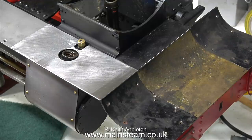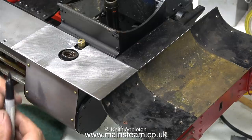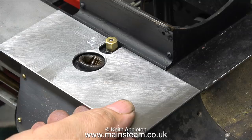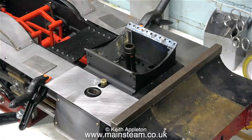I'm going to silver solder blocks on the front curved part to support the front of this running board extension. Currently I'm marking the position of the piece of metal, because it was a little bit too wide on this side. I made a felt tip pen mark at each end, then drew a very fine felt tip pen line, and on the belt sander I removed the excess. Now, just like the other side, this side fits perfectly. With the help of a couple of spring clamps and a piece of bar across the front, it's looking good.